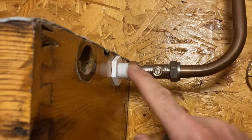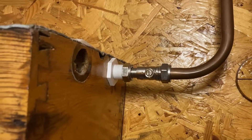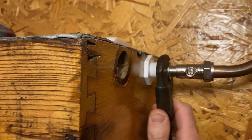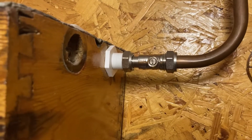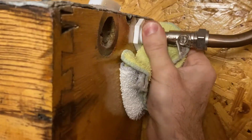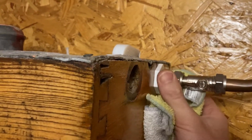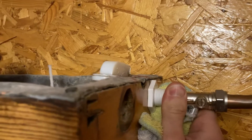So I've turned this off. I'm going to replace the ball cock in here today because the old one — I was looking at it before and I think it's just old. So loosen that, just a tiny turn. It's only plastic so it's not very strong. I'm going to replace the ball cock because I didn't trust the old one. The old one that's in there is about eight years old — float cock, filling valve, whatever you want to call it. Loosen this; there should be a few drips in it. I've got a rag just to catch anything.